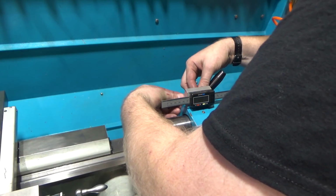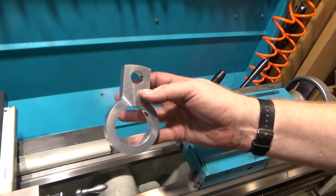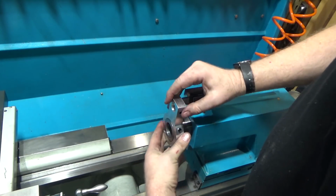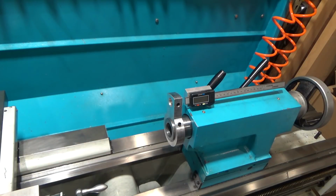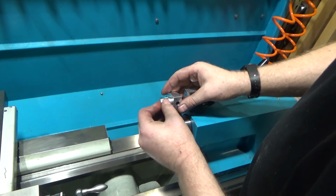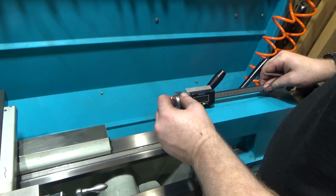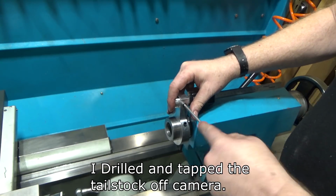Which is just these two screws right here. So the next step is going to be to put this guy on, and it's such a tight fit that in order to get it on, I actually have to put a little Vactra on it. Otherwise it just sticks. It's a really tight fit. There we are. And once you get on, there is no slop. Okay. Next is the clamshell. So the reason the clamshell rotates is so all these parts could orient without making it challenging. I made all the tolerances so close that this is a really tight fit. Okay, so there we are in.